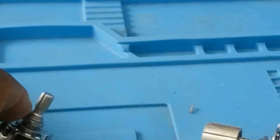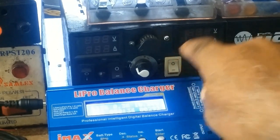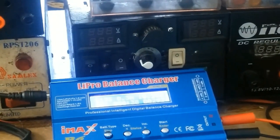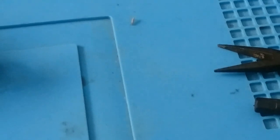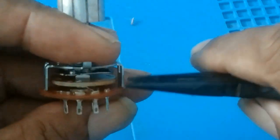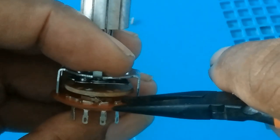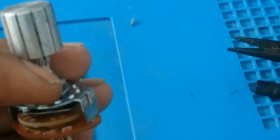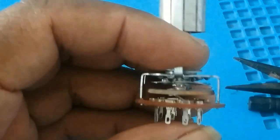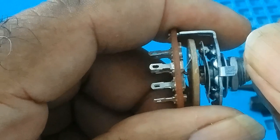The first power supply I did — which is this one here — I used the pliers and I bent. I put it in between here and bent the contact or connector, brought it further apart, and I filed. So when I turn the knob it will float — it will make contact but it will float.